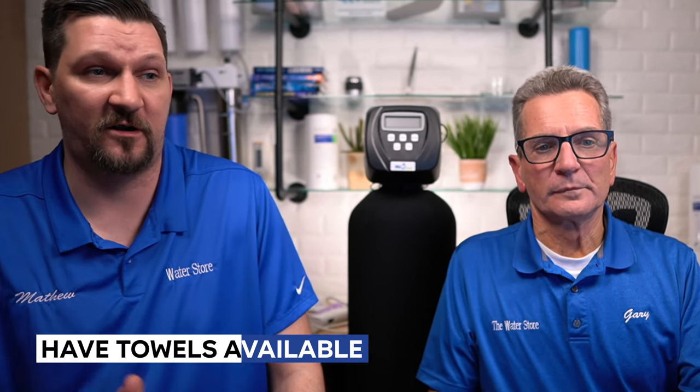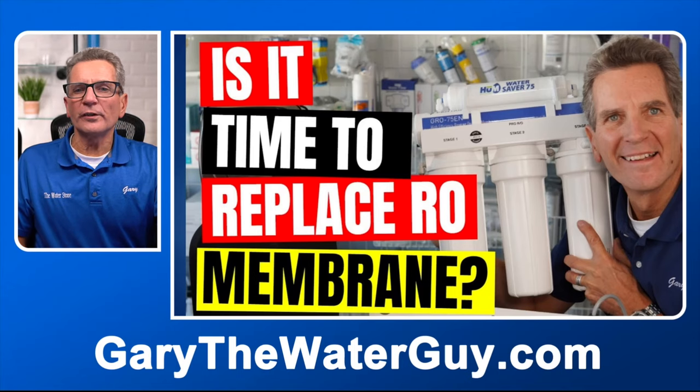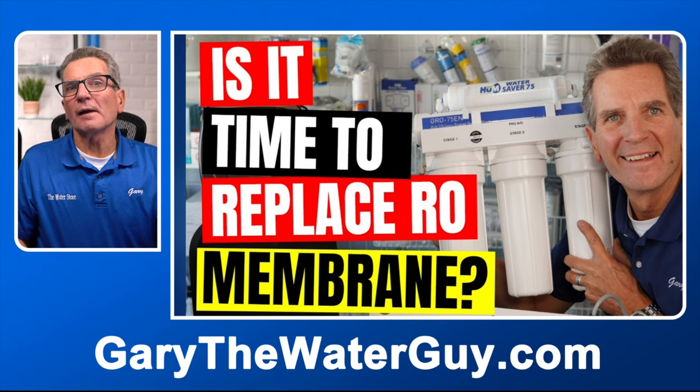Any potential common areas of difficulty for someone doing their own filters on the reverse osmosis system for the first time? Not really — as long as you make sure you shut the water off, turn the valve off on the tank, and relieve the pressure. Make sure you have towels — I recommend blue paper towels because they really absorb the water — and a bucket to put your filters after you've done the filter change. We've got YouTube videos that can help you through this process — one about when it's time to replace the membrane, how often the filters need to be changed. Another way to tell if the filters need to be changed is if your flow slows right down and it's not your tank — your filters might be clogged.